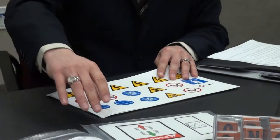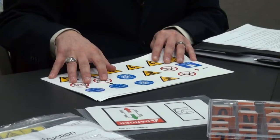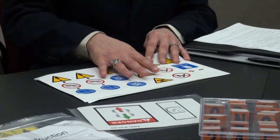Other times, like if some of the decals are plastic decals or harder substrates, and we want to convert them all to the vinyl decals or polyesters, whatever would be on a sheet, sometimes they were over-engineered in the first place. And if that's not needed and they work just fine as the vinyl decals, sometimes a redesign is necessary. Another thing that they may need to sacrifice is size. Sometimes if some decals are overly large and don't fit in the packaging properly, they could either consider a redesign to make them smaller, or they can consider other options that we'll discuss within the kitting process that would exclude those from the kit itself.